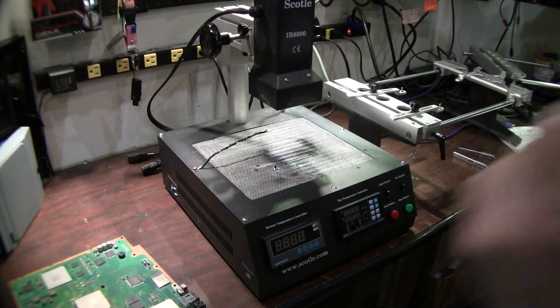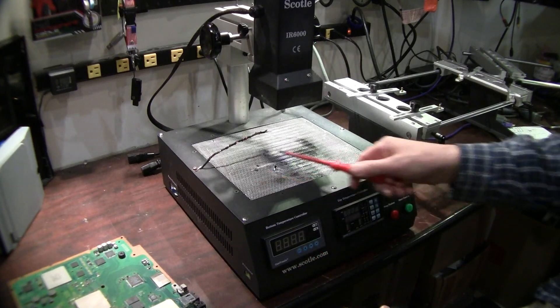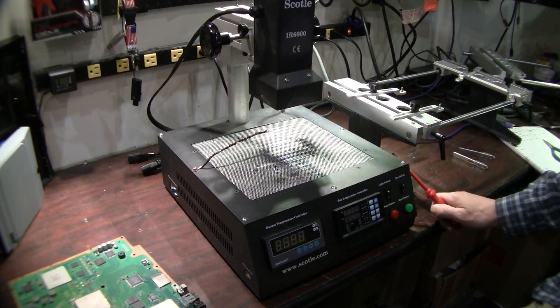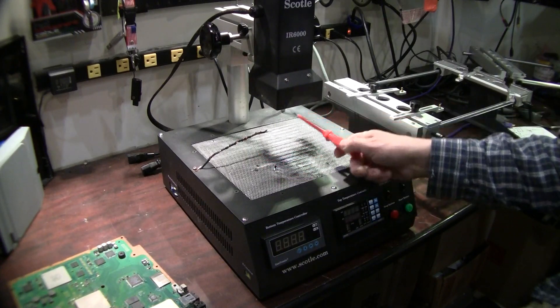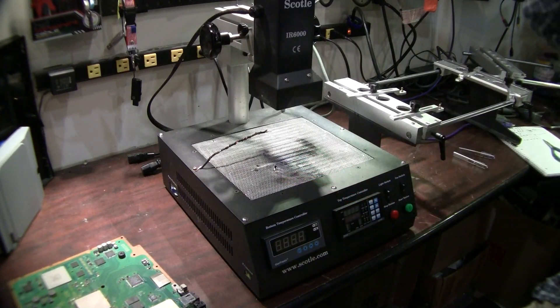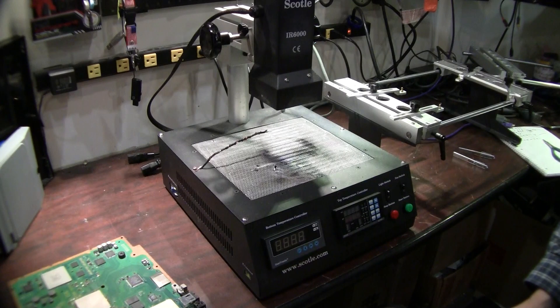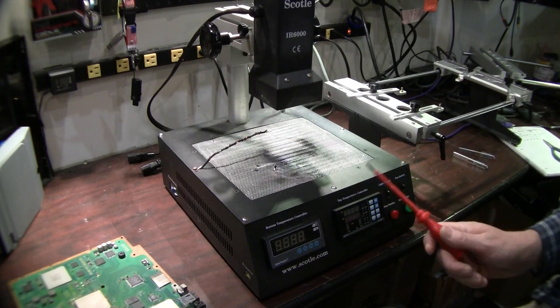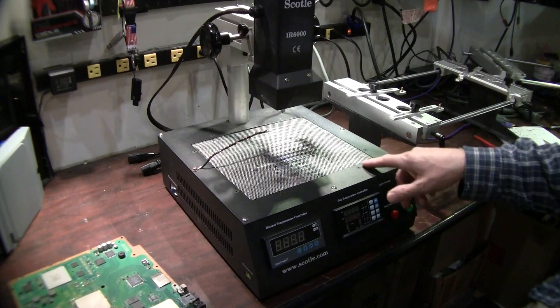You will have to do some masking on your board. The machine definitely runs hot — it heats up very fast. It has three large plates mounted horizontally in here. This is the IR6000, I think it's the V3 on that unit with the larger plates in the bottom. So it has a full rack of plates, a little bit larger than the older IR6000s, and they heat up very quick with a 220 volt converter. One thing I did notice is at 3000 watts the converter was warming up, so definitely use a 5000 watt converter if you can, because your 2 to 3000 watt converters are going to take a little bit of use too. This unit seems to pull quite a bit more juice than the older IR6000, so it's definitely pulling more wattage with those extra plates in the bottom.